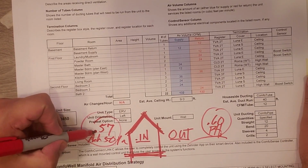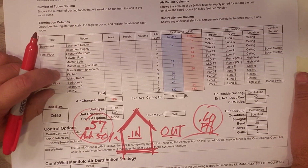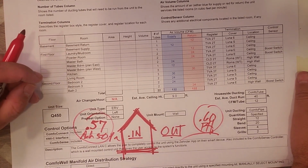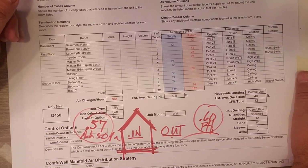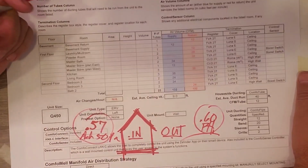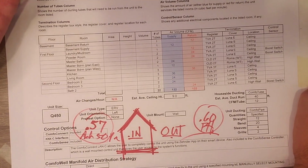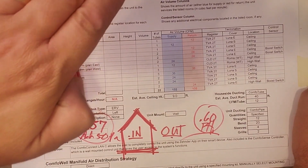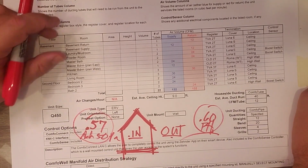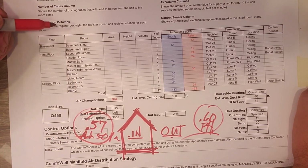And the other thing to remember is that, Jake, we've certainly had better numbers, but you got to remember on that Hilltop Aero project, probably about 70% of the house is suspended above the ground. So we have that whole added layer of surface area that in most cases would usually be a basement against the ground, which really doesn't leak any air, if any. So it becomes a little bit more of a challenge when you take that building and just kind of throw it out there in the air. But anyways, 0.57, hell of a job, Jake and Aero Building and the framers and everybody involved.